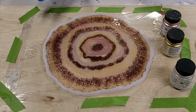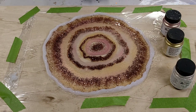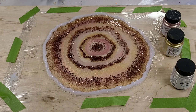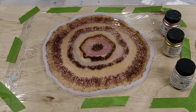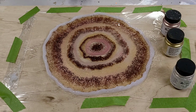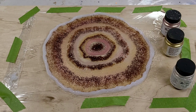Now depending on the resin you're using, that will determine how long you need to leave it. The resin I'm using is a 24-hour cure, however it is quite hot right now. We want to get this to the point where it's still very sticky and bendy but not runny — if you wait too long the next step won't work. I'm going to check on this in about four hours. I did one recently where I left it for six hours and that was too long — it was fully dry, not sticky at all, and I wasn't able to bend it.